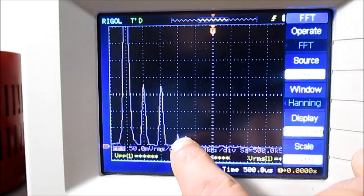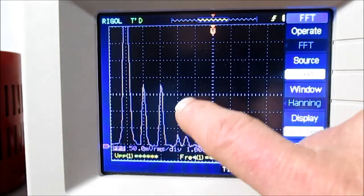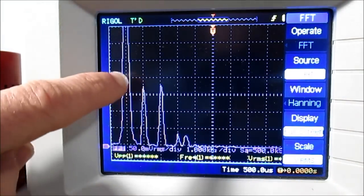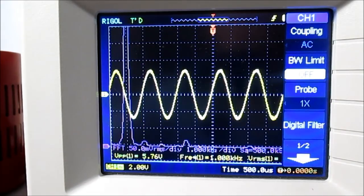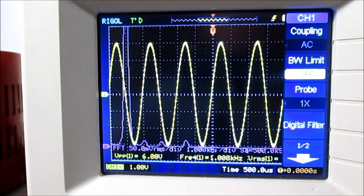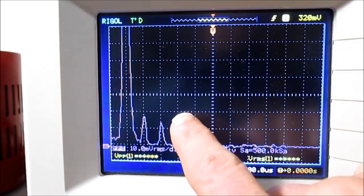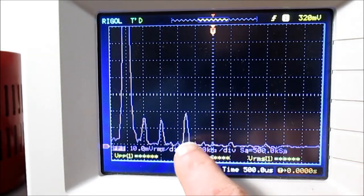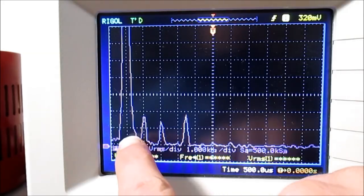Let's check the distortion. That little bump is the 1% 4.5 kHz pilot signal, as usual in my test — about half a graticule. So about 7% second harmonic and 7% third harmonic. Now with these single-ended Class A type amplifiers, they tend to get a lot less distortion when you turn the amplitude down. Turning it down, they're well under 1% now for the second and third harmonic. It's pretty doubtful those would be audible in any sort of music.